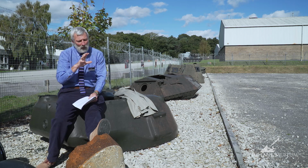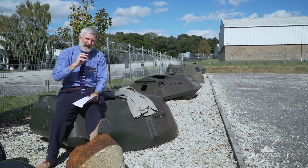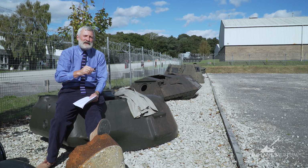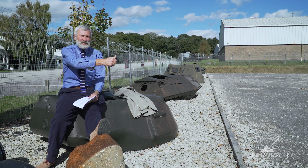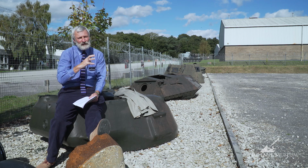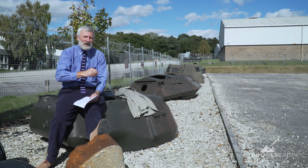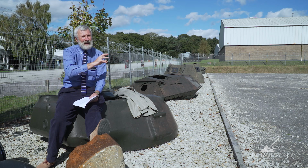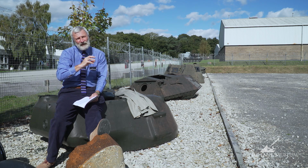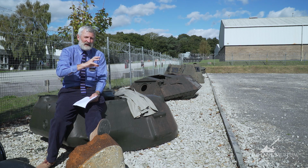And that's because the outer casing is where the drum brakes are, but what we're looking at inside, that's causing that spin, is some reduction gearing. In other words, the engine is powering a shaft, there's a takeoff going to the sprocketed wheel, which is obviously driving, biting into the track and pulling the vehicle along it. Actually, there's reduction gearing in there, which is going in the opposite direction to take some of the power out of that thrust that's going to the sprocket. And that's why the drum's going in the opposite direction, if you look very carefully.